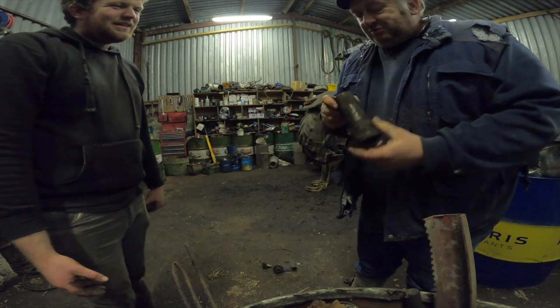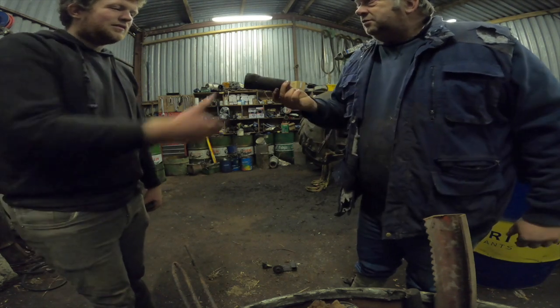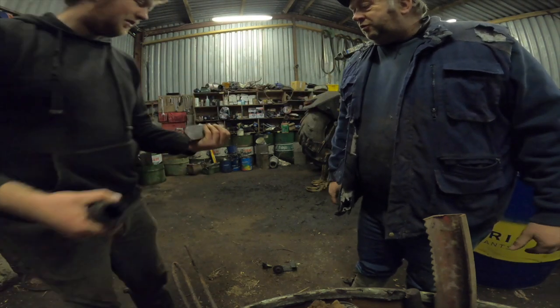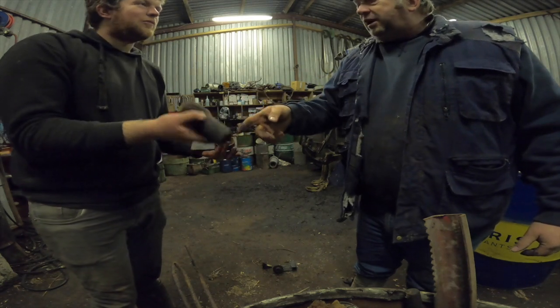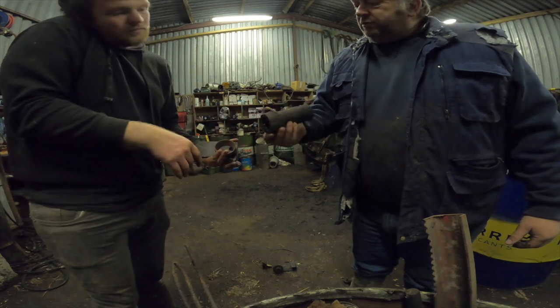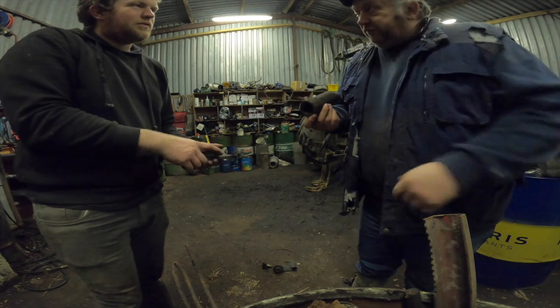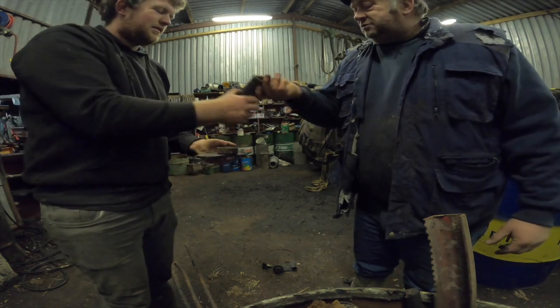So you can imagine what happened. And did you fix that? We fixed it, then the thing came off. The first time we put her under a bit of a pull, the next thing was this clatter, bang, bang, bang. I had to take it out, and luckily I was able to take that off. We worked away, and I had to get a new crown wheel and pinion for the front axle, build the whole thing back in, and put a whole new four-wheel drive shaft on it.